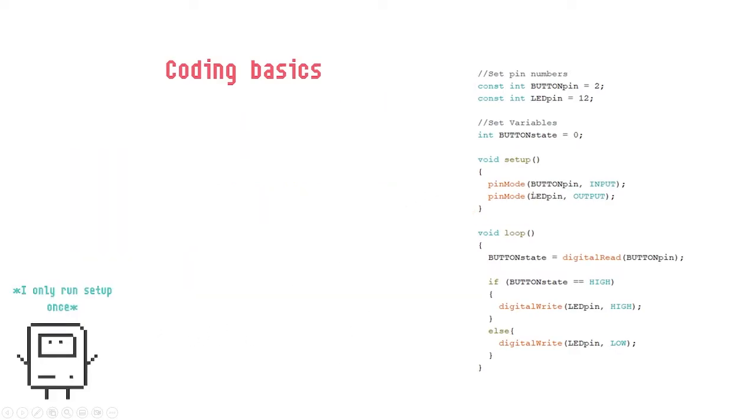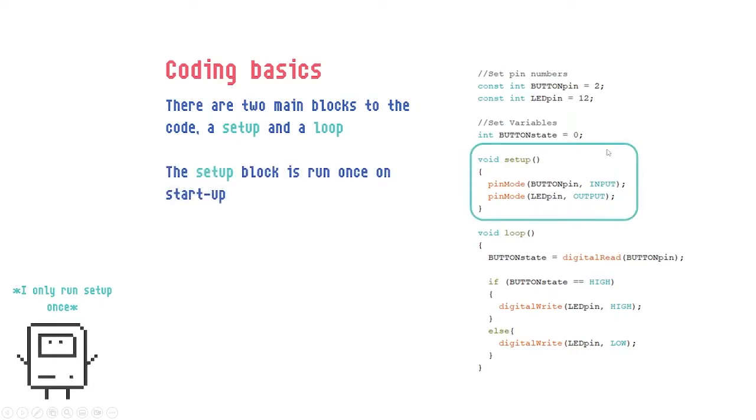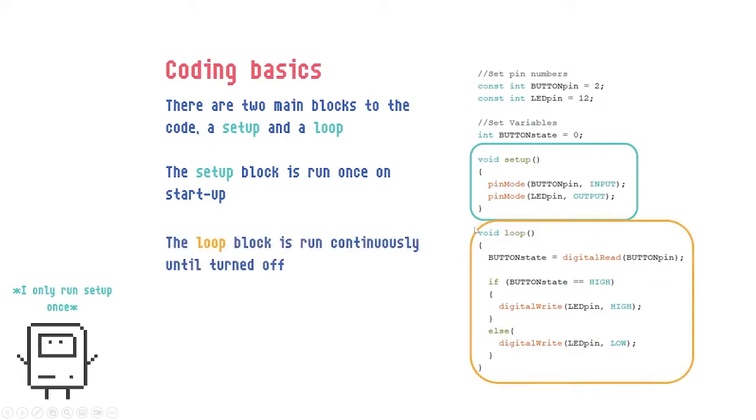In the code for the Arduino, there are two main parts, the setup part and the loop part. So that would be the setup part that only runs once during startup or when you power it on. And then there is the second part which loops. Okay, it's a loop. So it is continually running when the computer reads the first line and second line and third line and then goes back to the first line until it turns off. When it turns off, it stops running, and when you turn it on, it goes to setup again. Okay. Run once, setup, run many times, loop. And the top part here is the place where I put parameters. I like to keep things neat and tidy, so I will put it there.